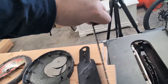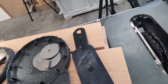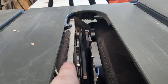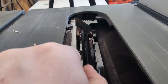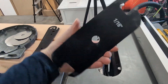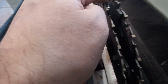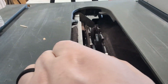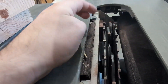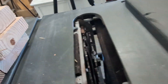This is your typical saw blade, but this is a dado blade — essentially two saw blades with chippers sandwiched between them. The chippers alternate within the two blades, creating a massive thick blade. Everything between the two outer blades gets chipped out, and that creates your dado cut.